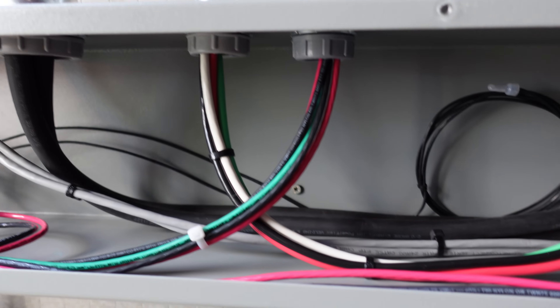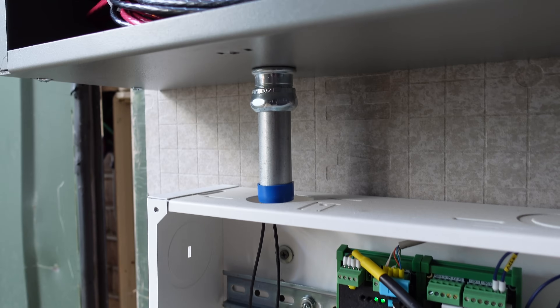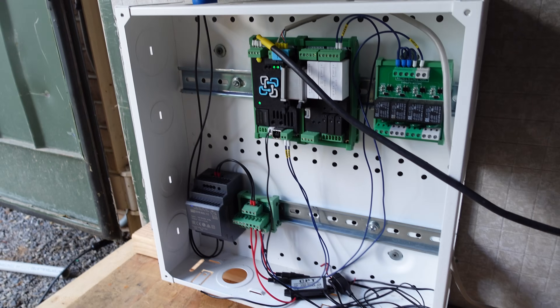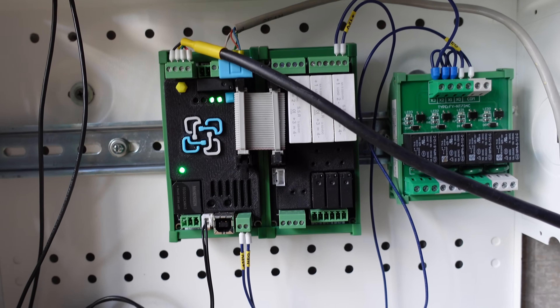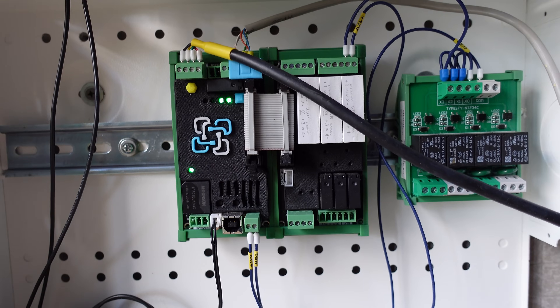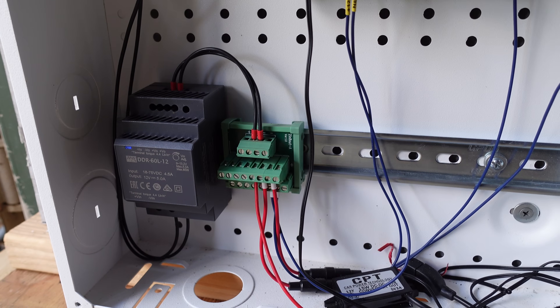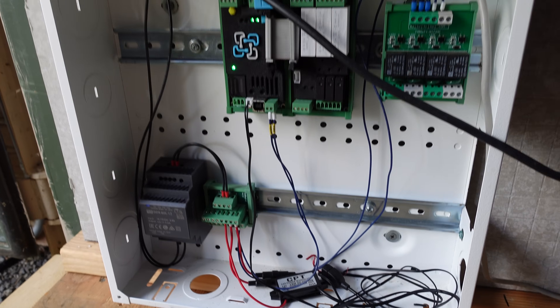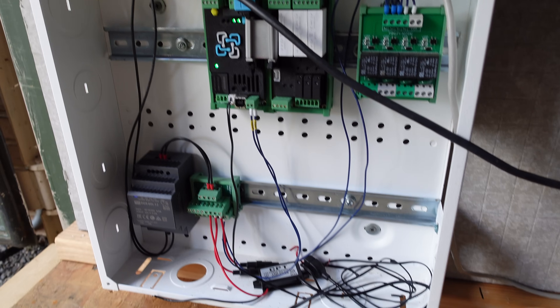Down in the wire trough, I've tried my best to keep the cables organized — it's not always easy. There's a loop in the back coming off the bus bars for battery power, which goes down a small conduit to my small enclosure for the Batrium. Some of this wiring needs to get reworked as well. This is a Watchmon core with an expansion board, and I've got four relays there as well. There's the DC-DC converter and a small terminal block for the 12-volt output. There's going to be a Raspberry Pi eventually and possibly another block of relays — I haven't decided yet.